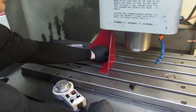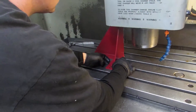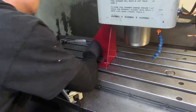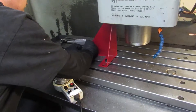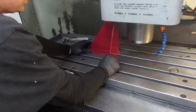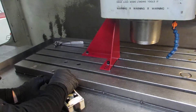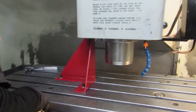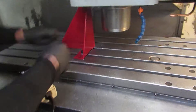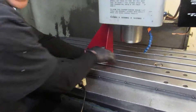Insert the bolts the same way. Make sure the bracket's a little bit loose — got a little play. Take your Z axis and just put very slight pressure on the head. Then finally, finish by tightening down all 4 bolts clockwise with your ratchet.